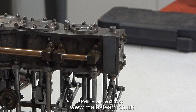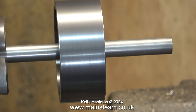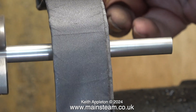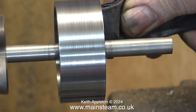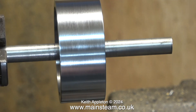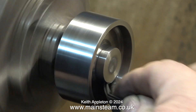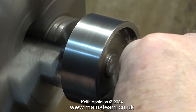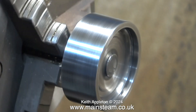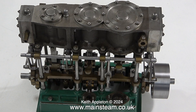The best way to clean up the flywheel is to mount it on a shaft in the lathe and spin it. It's a long way from the chuck — this is a health and safety consideration. Now the flywheel is spinning, it's far easier to clean. I'm using wet-or-dry sandpaper — 400 grit — then I finish off with some Scotch-Brite. One small credit to the engineer who built this engine: just look how true this flywheel is running. When cleaning the inside edges I never put my fingers all the way in — I fold the sandpaper. A quick final cleanup with Scotch-Brite and it's time to fit the flywheel back to the engine.